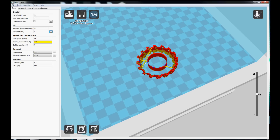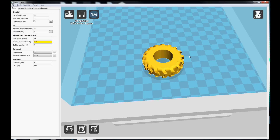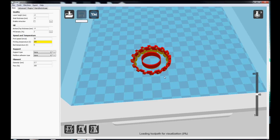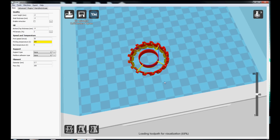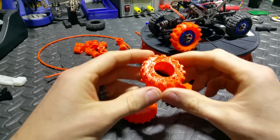To make an equally squishy tire all the way around and help support the top layer when bridging, I reorient the tire with respect to the infill. The infill is locked into position relative to the build platform, so if I move the tire to where the lines intersect I can put them right where they'll be most beneficial. This is a really useful trick for any type of part that you're printing with low infill.